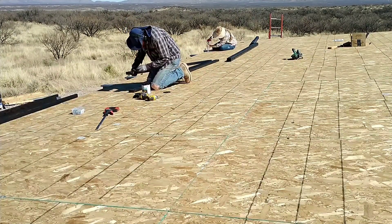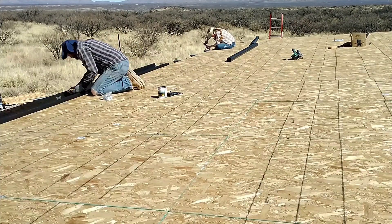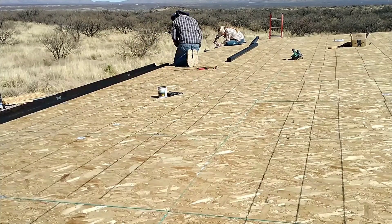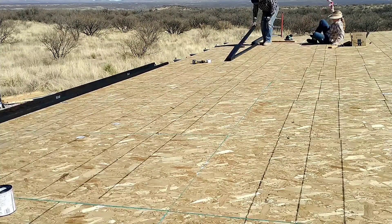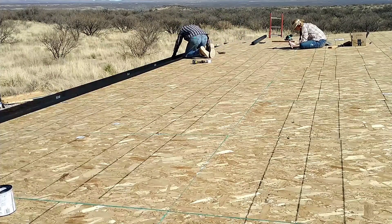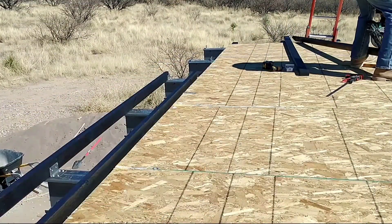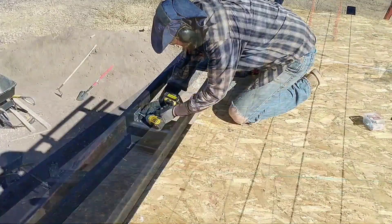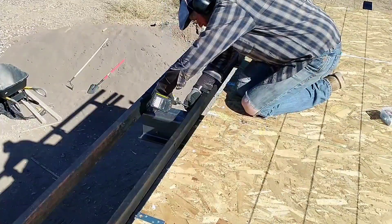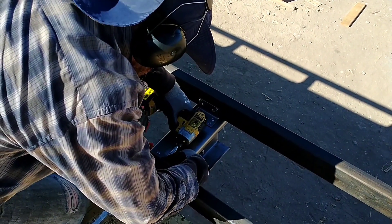April is working on sealing up the seams between the sheeting on the roof, using silicone and then going back over that with an elastomeric paint to seal those joints even more — just wanted to get a nice airtight seal on the roof before we put on all the layers. One interesting note about the sealer we used: it's a polymerizing oil. These penetrating oil sealers use a polymerizing oil where the molecules form long chains when exposed to oxygen and allowed to dry — almost like plastic. It actually sinks down into the wood, and when it dries it polymerizes and bonds together. It's a special oil that changes at a molecular level once it enters the wood.